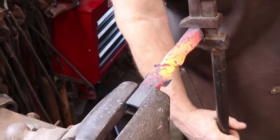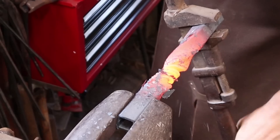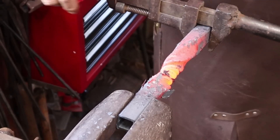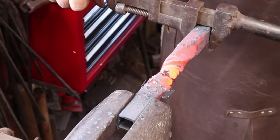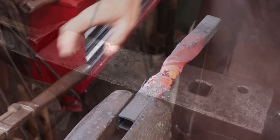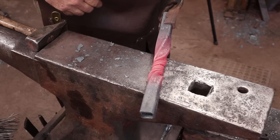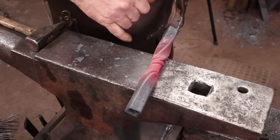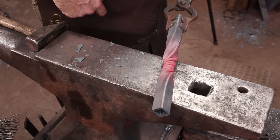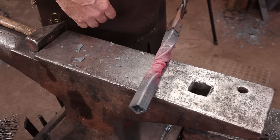This is just a piece of tubing with nothing special done to it other than quenching the ends to support the twist. You can already see what's happening — some of it is collapsing on itself because it just can't support the thin walls. With some controlled heat you might be able to control that effect and you might decide you like it, but generally it's why people don't twist square tubing. If you heated it back up and kept going, that's not a bad effect — a little rope twist — but it becomes so much skinnier than the original tube.